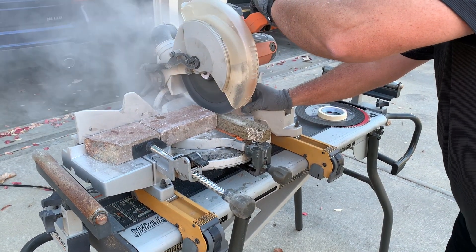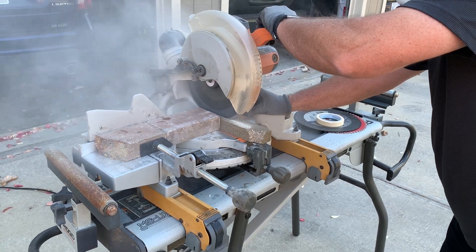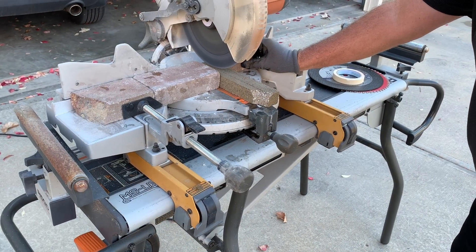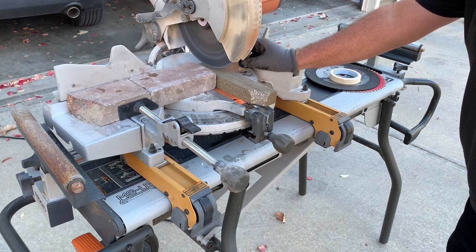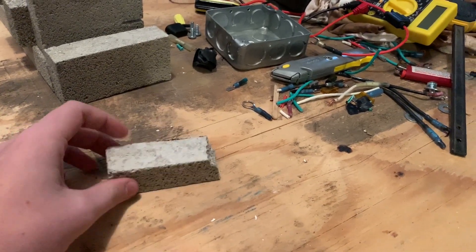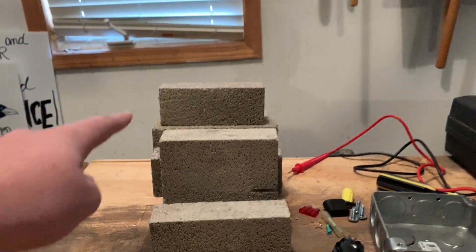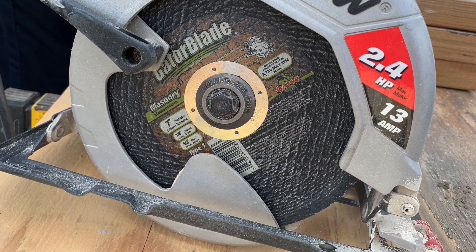Now that you have a basic understanding of how the kiln works, it's time to cut some bricks. In my design we only had to cut out the corners, but for you that could be completely different — you could make a hexagon and cut every single brick. When you're cutting your bricks, make sure to dunk them in a bucket of water so they don't break, and you can get some pretty clean cuts.